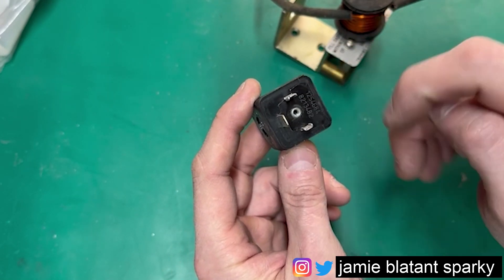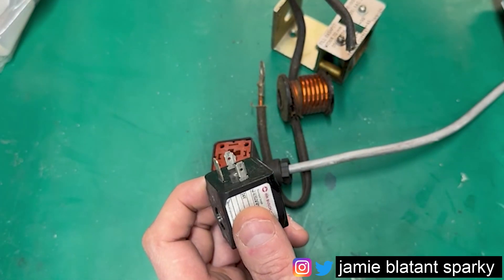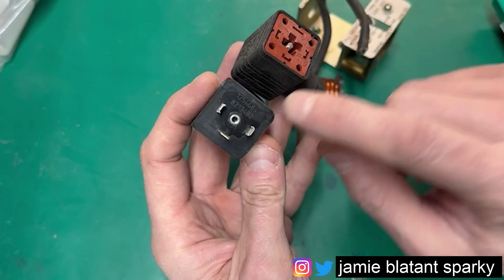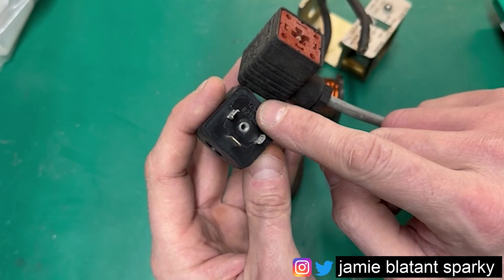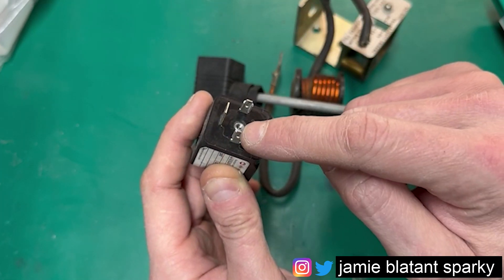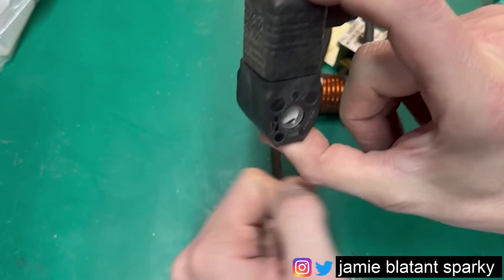What's interesting is the pin arrangement on here. This pin arrangement is originally done for solenoids and it fits to a plug like this. This is the standard one I see most of the time, but you may come across ones that look like this as well - that's a non-standard one they use when trying to save money. I'm going to work with this one as I've got better adapters for it. You'll see there are four pins available, although this plug's only got three fitted. These are normally the power pins - live and neutral - and this will normally be an earth. This plug has been reused for switching, so you could have live in, earth, neutral, then a live out for signals. But as a solenoid it has one pin there and one pin there, and this plug clicks on it and screws down, going on top of your valve.